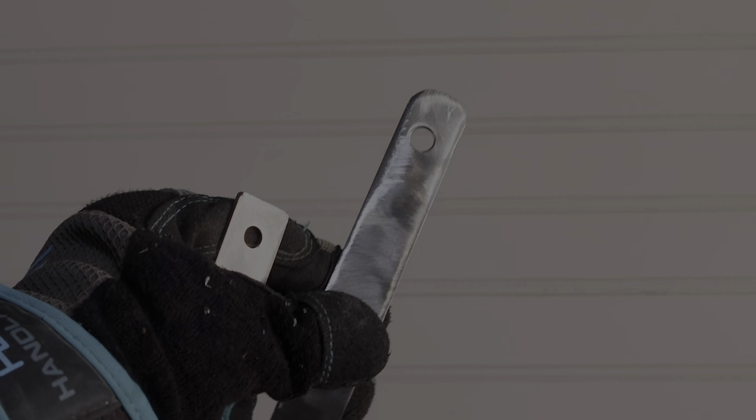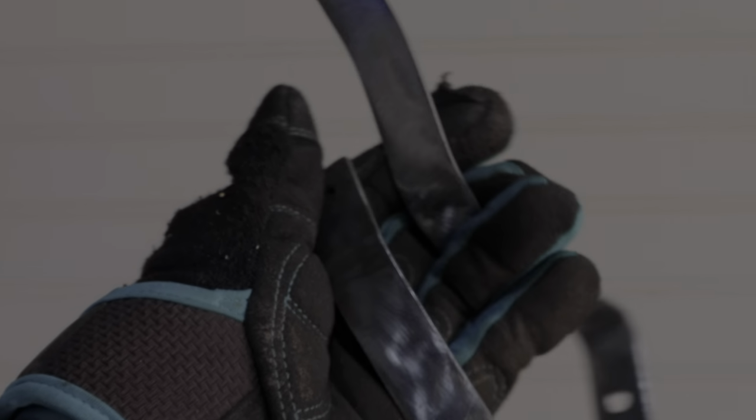Okay. Put a nut on the back of that one. But rounded out the ends, at least on the sides that show. I just kind of stub the corners on the ones that don't. And then hit them with the flap disc to get all the markers off.